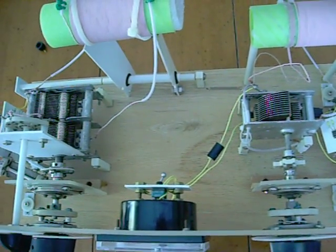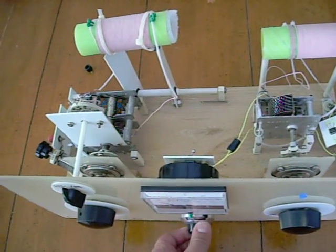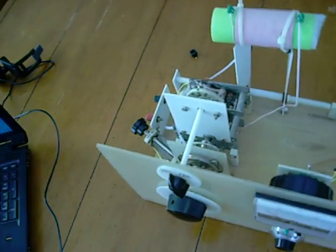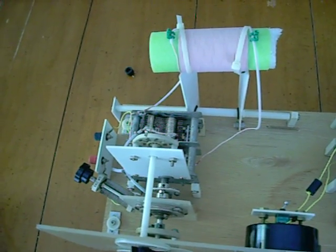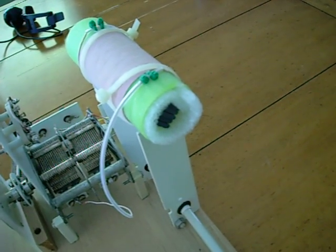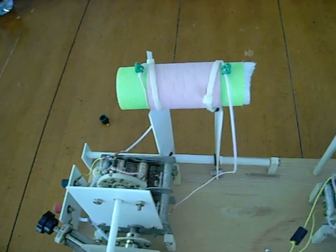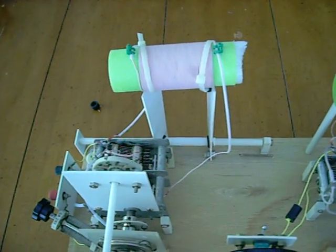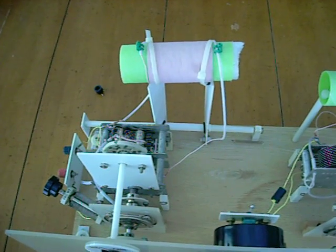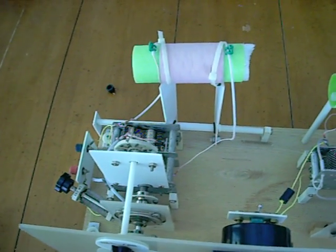I've achieved that physical adjustment with some dial cord and four little wheels. They go around the perimeter of the board so that when you turn the knob, it allows that traverse back and forth, changing the amount of coupling between the antenna ground tank and the detector circuit. This antenna ground tank uses a ferrite core coil with 330-46 litz wire. As it stands right now, the Q of that coil is probably between 500 and 800, and with some tweaks it can go up to 1,000 or a little higher in certain portions of the band.